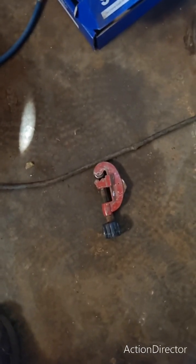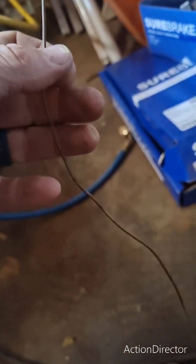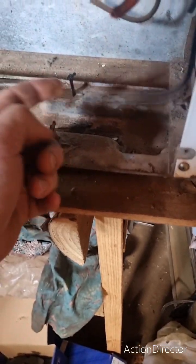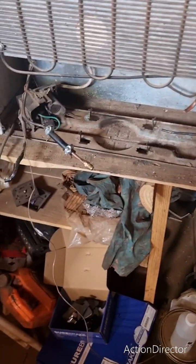After I did that it took me a couple of days. You can see this whole wad of oil on the floor — I drew it into the floor because I just let the capillary hang down, and eventually it came clear. All of the oil came out. So I just charged it up and left it overnight. The heating line had the same problem, so I flushed that through as well. I'm going to change out the dryer now and put the compressor back.